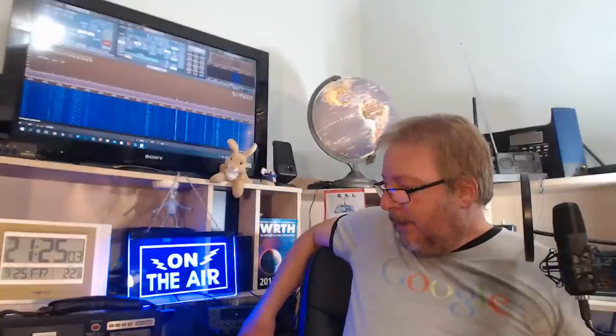Let me check if I can compare in some way. I'm going to try something. I'll have to switch, but let's see here. So I got shortwave. I'll punch in the weather radio frequency that I'm listening to, 6604, upper sideband. So let me just take it there. We're going to see here the bandwidth. So 2.2, I'll use the same bandwidth here, 2.3.